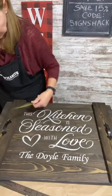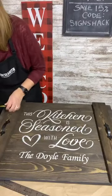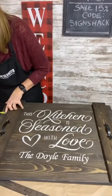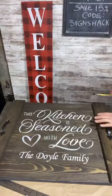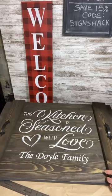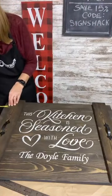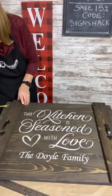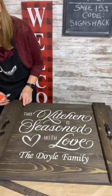And, ooh, that's a lot. That's why you want to measure to make sure it's about the same. So that's 1 3/4. And that's 1 3/4. And measure up here too, to make sure like at both ends you're not kicked in. Like this is 1 3/4. This needs to come out a bit.